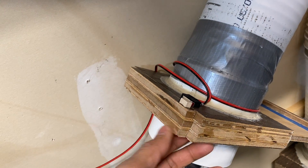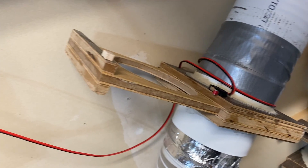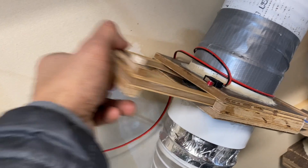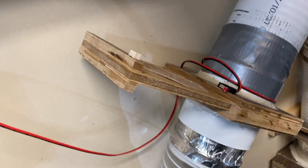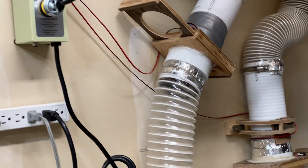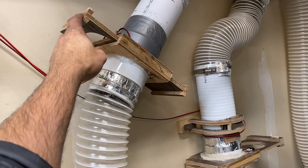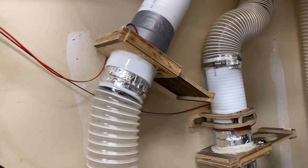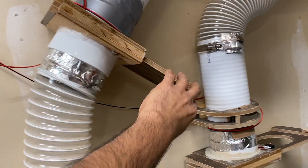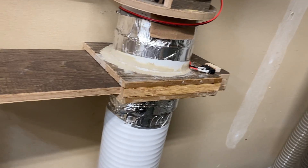As you can see the micro switch works just perfectly. We repeated the process for all the other blast gates — we now have all of them connected with the switch. The wires aren't neatly routed yet, so we'll take care of that later, but the blast gates work perfectly. They turn on the dust collector and are very conveniently located next to each tool. The previous blast gate was for the miter saw and this one is for the bandsaw.